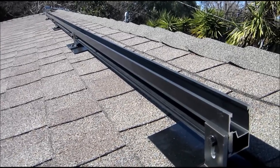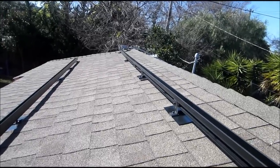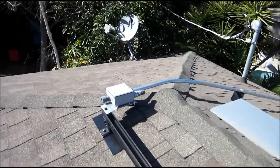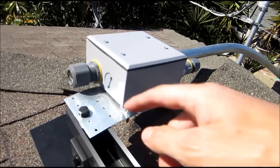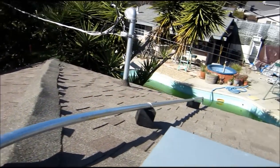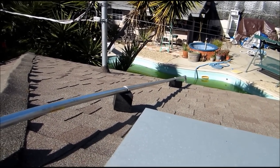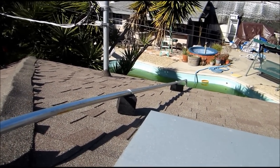Got the rails on — that was pretty straightforward. I bolted each footing. The rails are 10 foot 2 inches long, so I've got an extra 4 inches on the end, which allowed me some space to attach my junction box. The AC bus cable comes in here, the ground comes in here, and the EMT conduit runs down to the box on the side of the house into the main panel. Strapping is on every 3 feet from each box — ready for inspection.